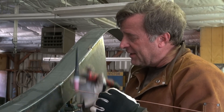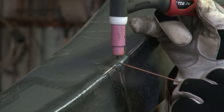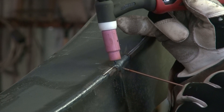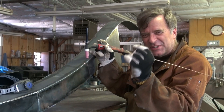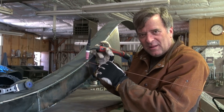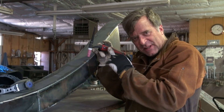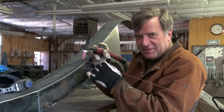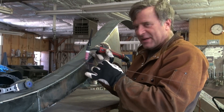The way I like to do it is when I come in here, I'm going to start at the end of this weld. I'm not going to start where there's no filler — I'm going to start on top of the old one, just a little bit. Maybe a sixteenth of an inch or so, so you can get that old weld molten back up just a little bit. Get that old weld molten again, then start working your way down, start adding your filler as you go.